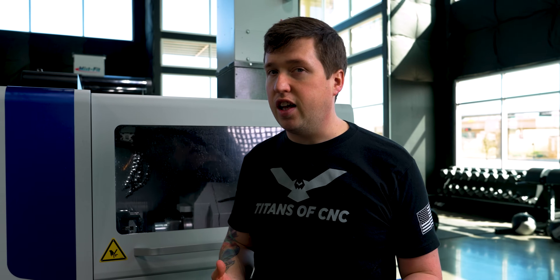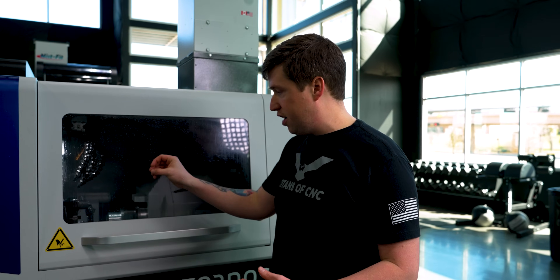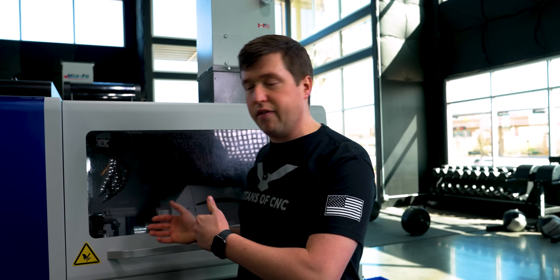After that, I recommend running about 50. If you get 50 out of 50 parts, that's a pretty good certainty that it's going to work fine. Always double check that. If it isn't working, there may be something in the conveyor belt or the ejection tray that you need to modify a little bit to make it so the parts land smoother. It's not uncommon and it's not a big deal — just assess it and fix whatever comes up.